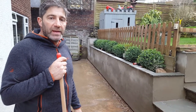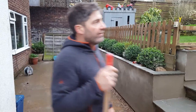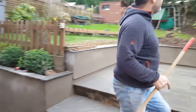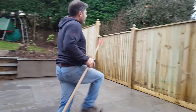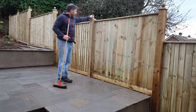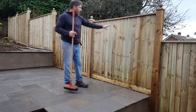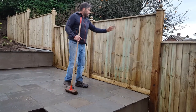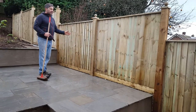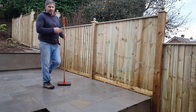If you look from this side up here, we've put a feather-edge fence, and on each panel we've introduced the post into the garden using a 4x4 with a little finial and a cap on the top. We've got a rock border on the bottom. On each panel we've alternated the boards, which gives it a little bit of contrast all the way up, so you don't just see a large expanse of feather-edge fencing.